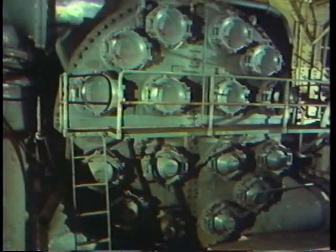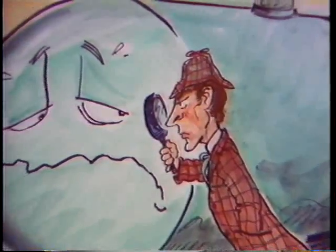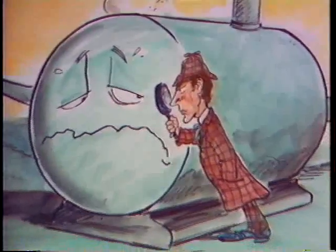There are also devices like plumbers' snakes used to clean drains and sewers — they remove the toughest stuff with a rotating scraper on a flexible cable. In large heat exchangers, tube bundles can be pulled out so the outside of tubes can be cleaned. Corrosion, scale, and deposits can be brushed off with wire brushes. Once the heat exchanger is cleaned out, a thorough and careful inspection is in order to find any leaks that may exist.